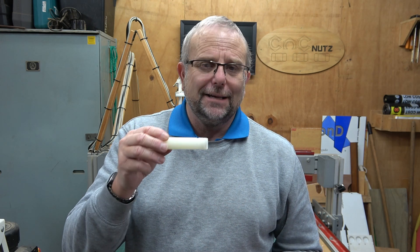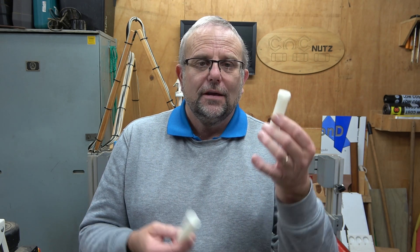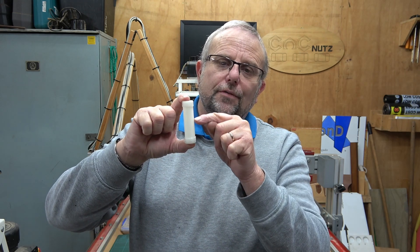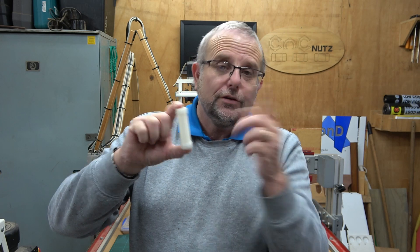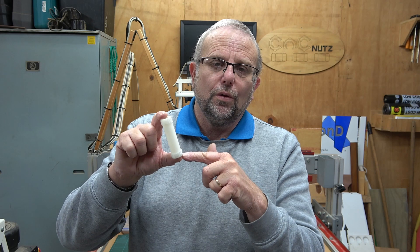And with that said, we can start making our pen holder. First thing to do is to take the plug nipple here and cut it down to length. Do not look up the internet for plugged nipples. We need to cut it down to 70 millimeters. Here's a piece that I cut, and I've also put it in the lathe and just skimmed off the bit of thread that I no longer want, just to make it look pretty. But you don't need to do that — you can leave the thread all the way down.